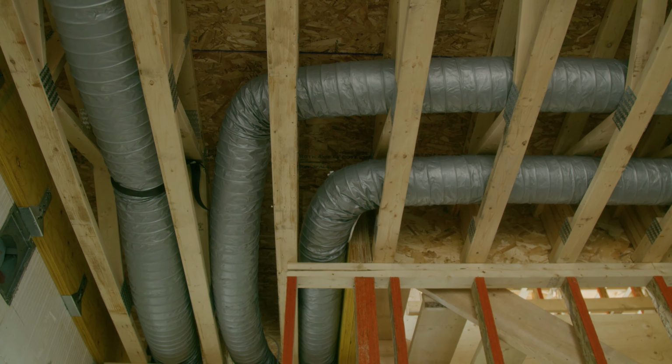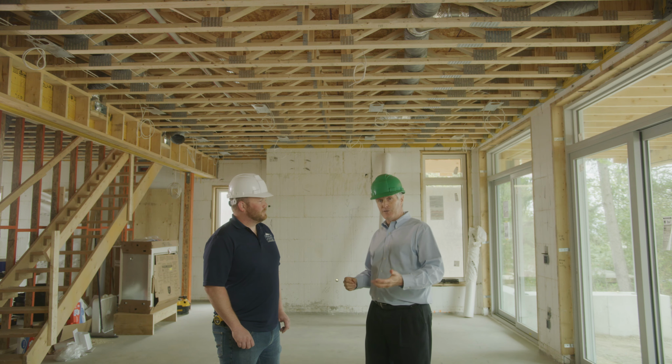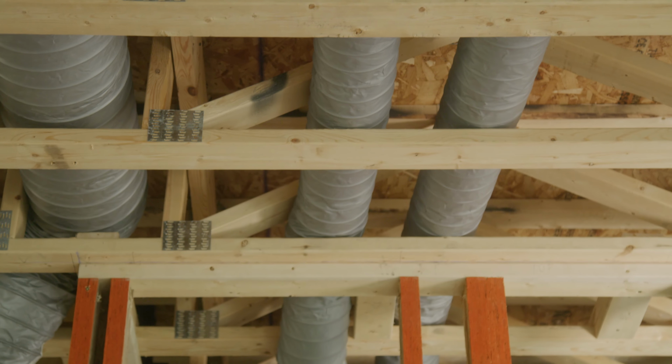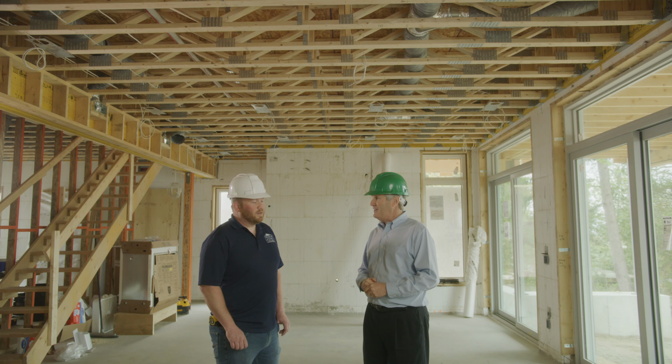So I just want to reiterate that with flexible duct, we're used to it when we talk about insulated flex for HRVs and ERVs, but this is actually just flexible duct on its own that comes in long lengths, 25-foot lengths. As long as it's pulled tight, you don't have a static resistance problem, and it's really durable, rugged quality. There are different qualities of flex, and I would encourage installers to choose higher levels of flex duct. I'm a huge fan of the Thermaflex product, one of the largest manufacturers in North America of this kind of ducting, and it worked out really well in this location. Yeah, there's a lot of advantages to it for this.